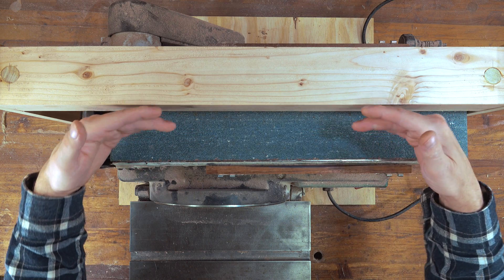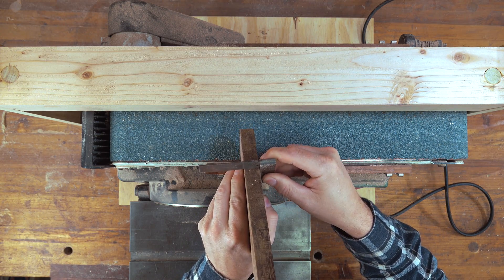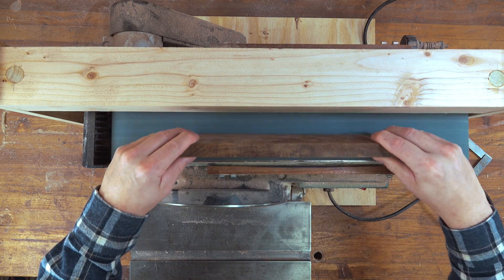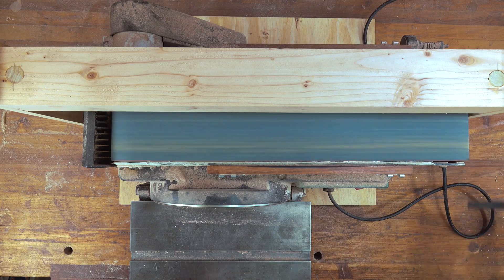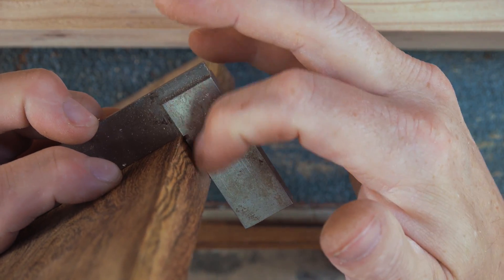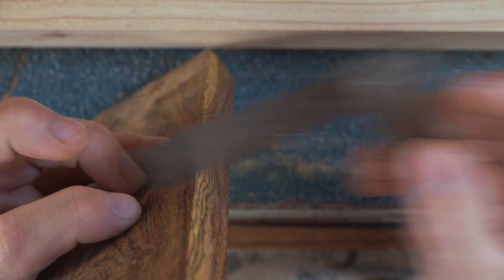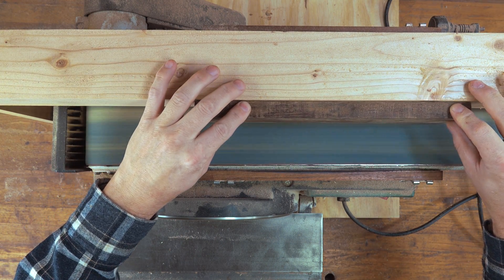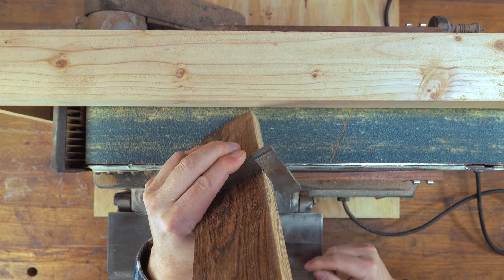I can hold a board in place and not have to worry about it moving a whole lot, but that's not what I'm interested in when sanding. I'm interested in making sure that I've got it at the right angle, so having this as an index — as an example, I've got a piece of bocote here. If I put my square on it, it's already pretty square, so I'm going to go ahead and make it so that it's not square. Now if we look at it, you can definitely see it's been sanded at an angle. I'm going to go ahead and use the fence and we'll see what it looks like afterwards — and this is afterwards: I've got a nice 90-degree angle.